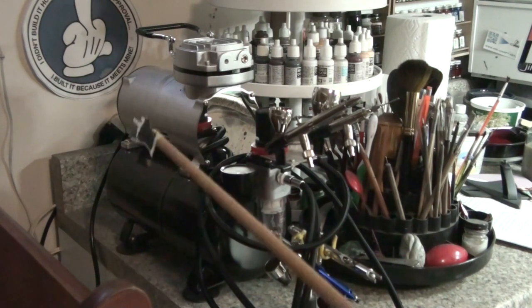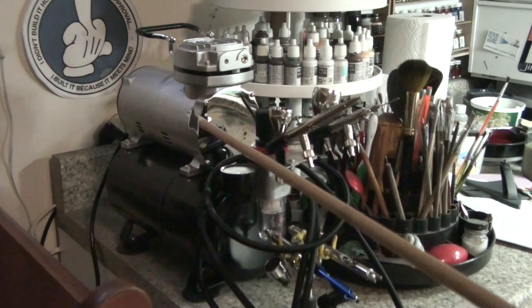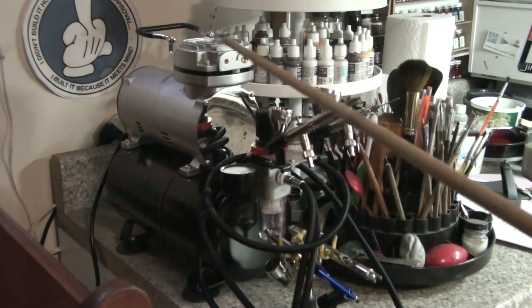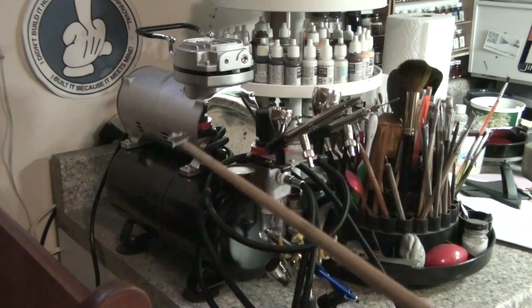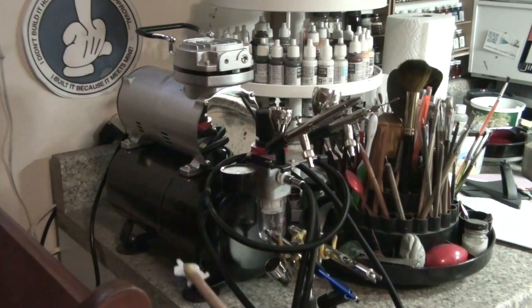If you get the ones that have the tank at the bottom, yes they cost more in shipping, but you end up with a compressor that's going to last a whole lot longer, be a whole lot quieter, and give you better airflow. Now, one thing about moisture: your tank has a valve at the bottom. You have to open it every once in a while and drain out the water, because your tank will fill with water, eventually rust, and you'll get a hole in it. Especially if you're in a wet environment like where I live — I live very close to the ocean, so it gets damp here and stays damp most of the time. I regularly have to empty my tank and empty my moisture trap quite a lot.